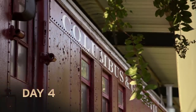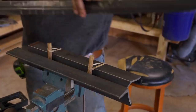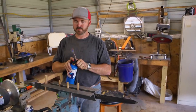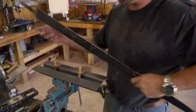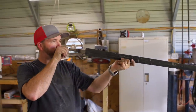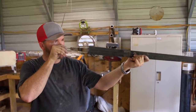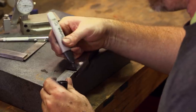Morning of day four. I got a lot of work ahead of me. My biggest focus is going to be getting the blade straight, so I want to get that out of the way and then go from there. My solution is to extend the width of the jaws with some angle iron, heat it up, and use some wooden dowels to put the proper pressure where it needs to be. She's straight — that's so freaking awesome. Now I need to make the handle. Time's running out, so it's a race to the finish.